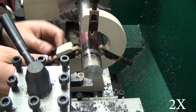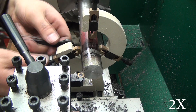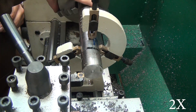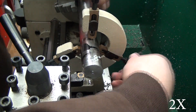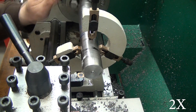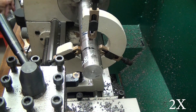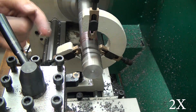The one at the top is the most important, which you're going to see here in a moment because I totally screw up my cut. I don't try to hide that kind of stuff — I'm new, so I'm not ashamed to show you my mistakes, as dangerous as they may be. We get all three of the fingers tightened and it's kind of trial and error — sometimes I got it too tight where it was pinching the work and sometimes too loose, like in this case where problems arise. I use a little bit of WD-40 on the work right where it engages those fingers, just to make sure that it rides nice and smooth.